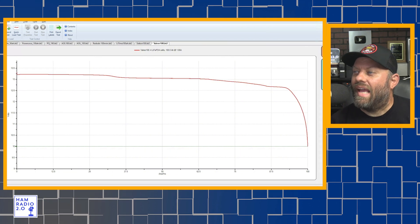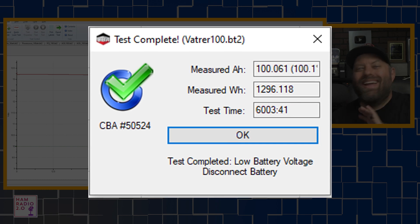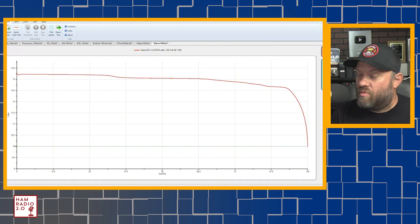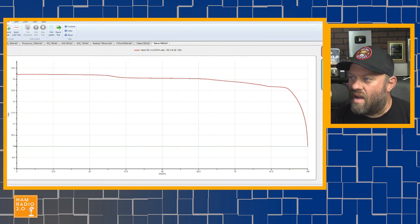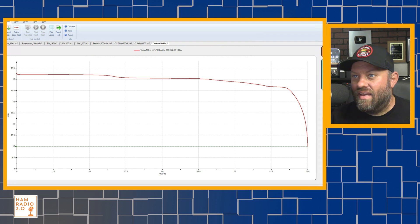Four days later, 100 hours later, we are running at 100.061 amp hours — exactly what it should be doing. Some of these batteries test two or three amps lower, some of them test two or three amps higher. But if you buy a 100 amp hour battery and it gives you 100 amp hours in a capacity test, I'd say that is a win. 1,296.11 watt hours, and the total runtime was just over 6,000 minutes. That is a very good capacity test for that battery.